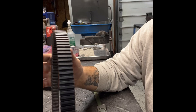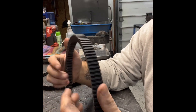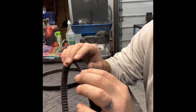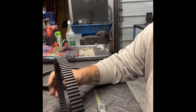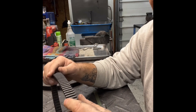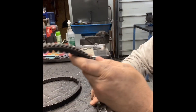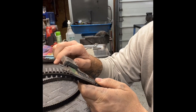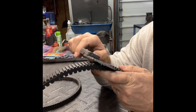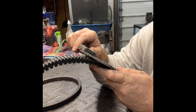You want to measure at multiple positions and then take the average. I'd call this an 0.820-wide belt. Once you first run it in, the really wide spots — anything over 0.820 — will get knocked down pretty quickly and it'll become a true 820 belt. Here's another belt just for reference: measuring about 0.820 there, a little farther — 0.820, a little farther — 0.820. This belt is also an 820-wide belt.